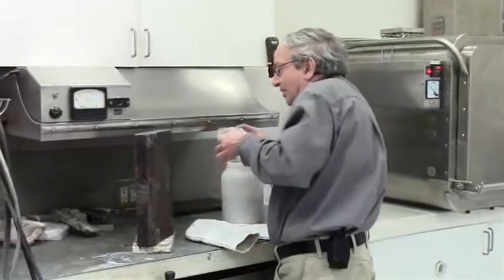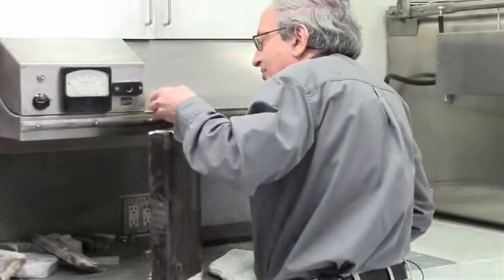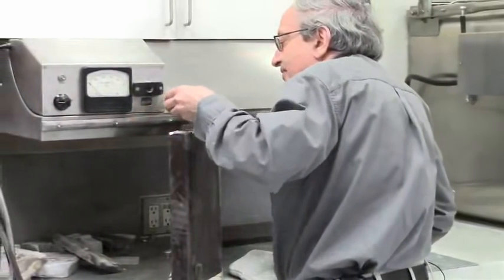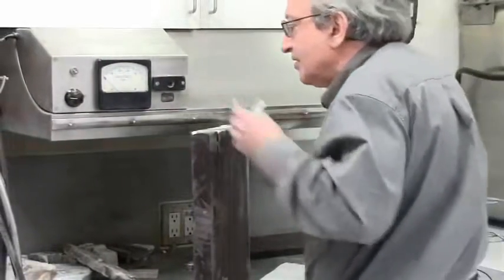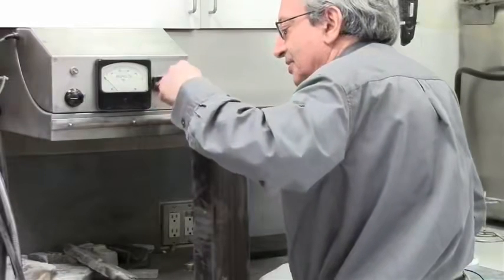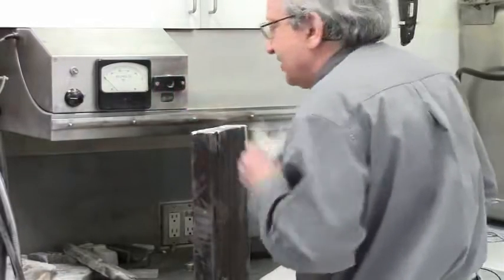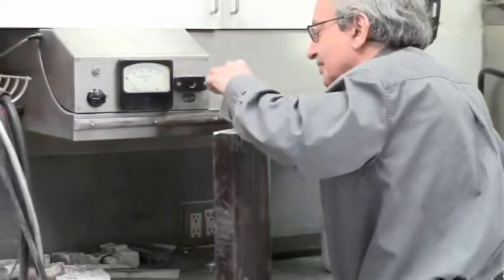I sandblasted it before, and now all I do is I take some of the same powder, the paint powder, and wherever there is a dent, I put in powder. It doesn't have to be accurate because I'm going to sand off the excess anyway. Okay, so the powder melts, and just beautifully becomes solid epoxy or whatever it is, polyester, and fills all the dents. It's already melted. Now we do the same. The powder not only melts but cures. Within a minute it will become rigid. Okay. Check if it's all filled. Yeah. And when we finish, we can just sand it flat.